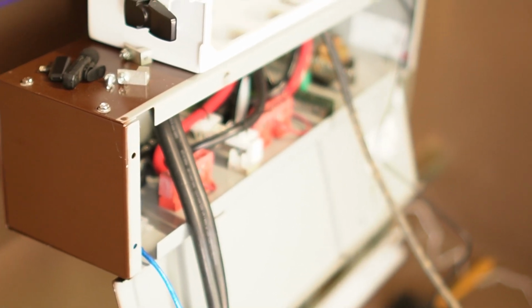For this install, we're going to be using an electrical gutter for the bottom of the inverter. And I don't mean an electrical gutter like you would go to the hardware store and go to where they sell downspouts and get something from there. This is a UL listed electrical trough, commonly called a gutter. Traditionally, you would see someone come into the 2-inch knockout with like an LB. That's like a 90-degree conduit fitting.